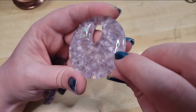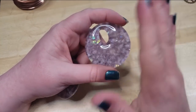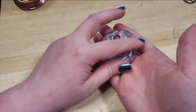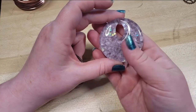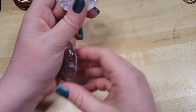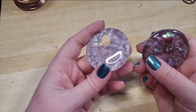We do have some spots. The way that I would fix this is I have a diamond bit grinder that is self-lubricating, and this is going to be for a different video, but I'll just grind that down to make sure it's all nice and clean, and then I would set this with fresh mold release, just as it is once it's been ground off, back into the mold, and then run it through the fuse cycle again. I could just fire polish it, but since I'm grinding out some space there, I want it to level back off. So that's how I would fix that. If you have a way of fixing glass that you'd recommend, I'd really like to hear that, because there's probably an easier way of going about it other than what I'm doing.